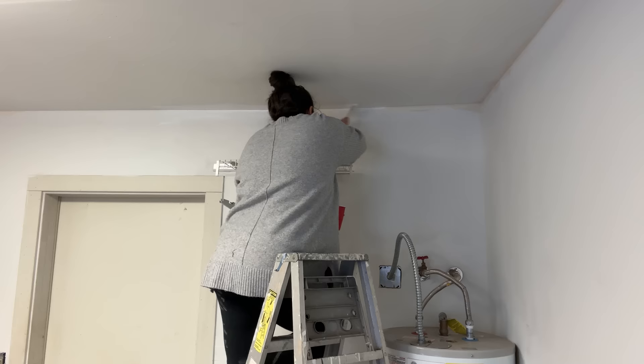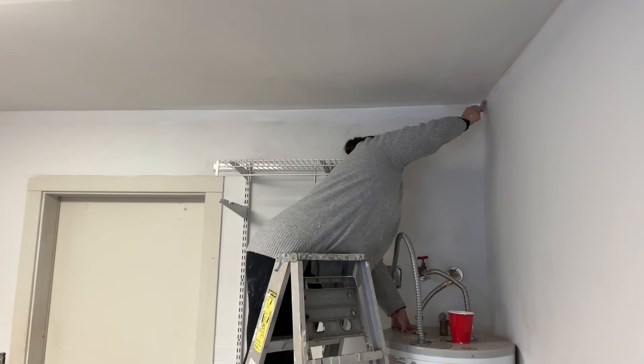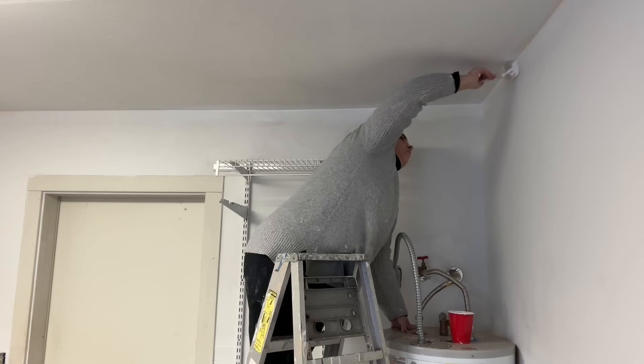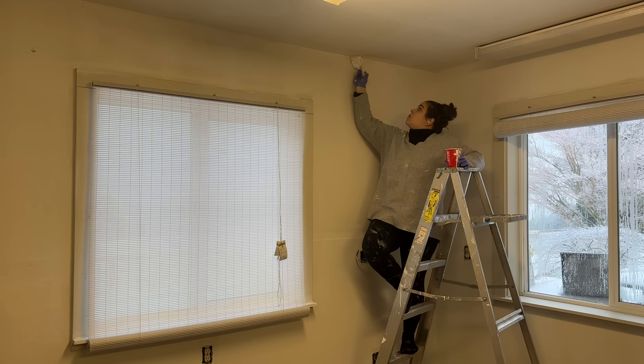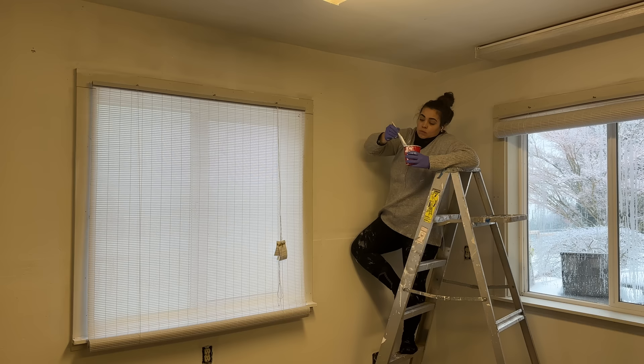Josh and I spent the first five years of our marriage remodeling the first home we purchased, and one thing I did was paint that entire house — I took two weeks off work and painted the ceilings, walls, trim, and doors. We researched what order professionals paint in. What they do is paint the ceilings first, then the trim, then the walls. I've done it that way ever since, because when you're cutting in, you only want to do it one time. If you overpaint the ceiling onto the wall, it's easy to cut the wall color up into the ceiling. If you overpaint the trim paint onto the walls, it's easy to cut the wall color up against the trim.